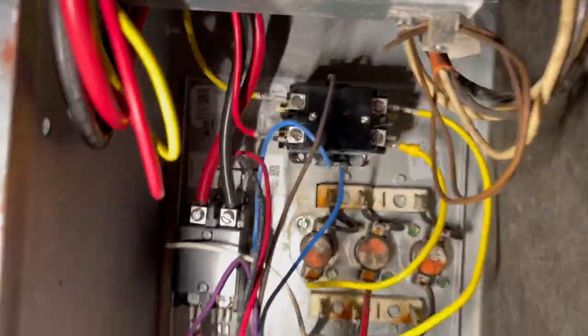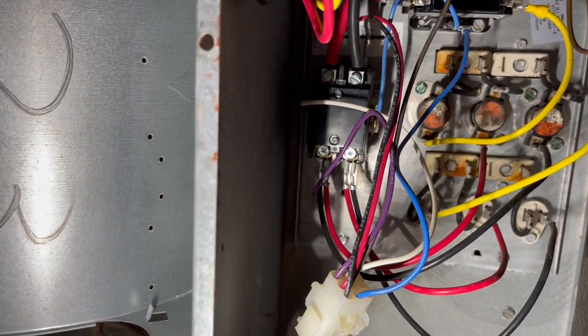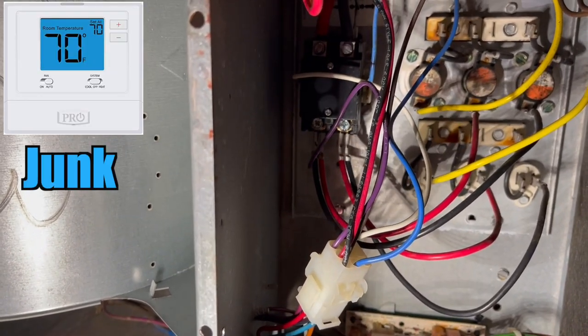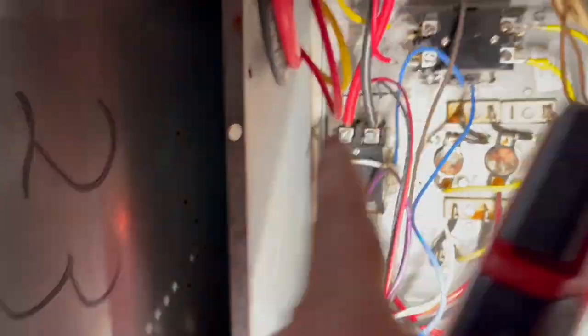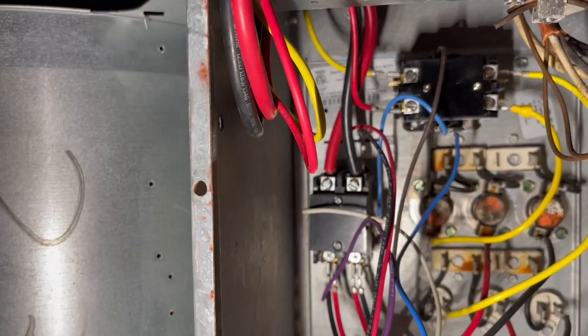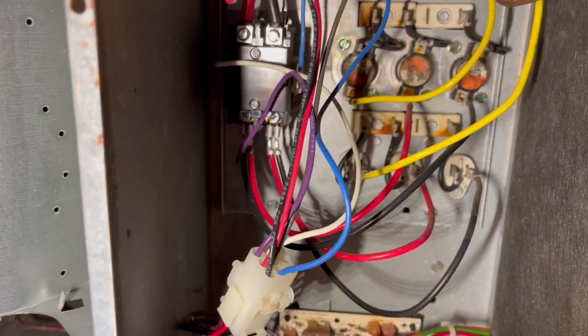It's a good thing I came up here — that spade was broken and that contactor was really making a hell of a racket. But it turns out we have a bad thermostat. When the wife turned it on from the thermostat, all we got was the fan — no contactors. It's one of those Pro One thermostats with a little magnet on it. I told her to smack it, she smacked it three times, and then I heard the contactors pull in. I'll grab a basic thermostat off my truck for tonight.